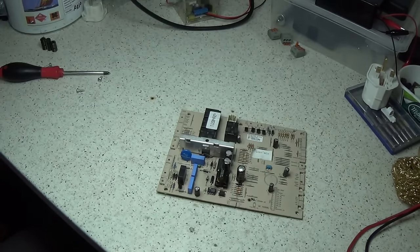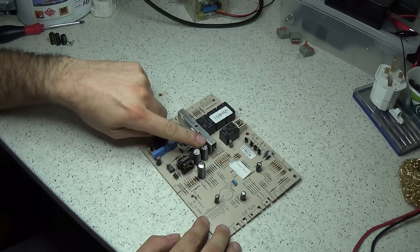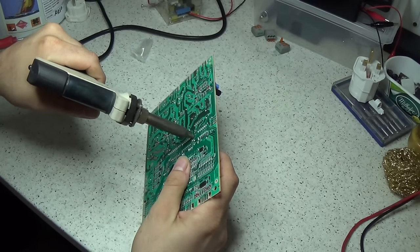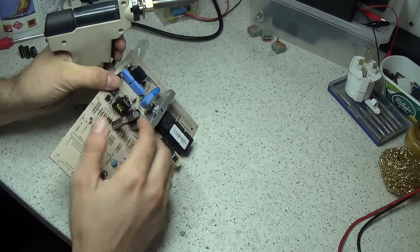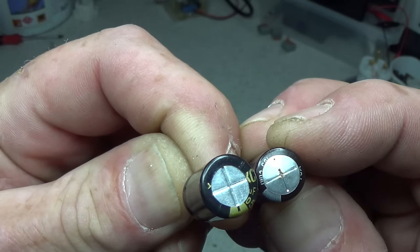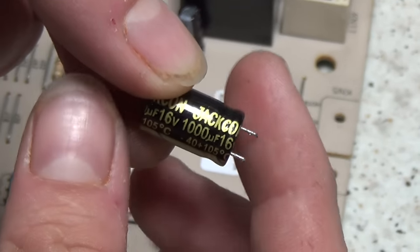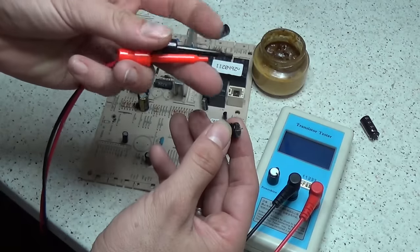Sometimes you will need to desolder chips to actually test them. We test them with a capacitance resistance meter, which I'll show you in a second - these can be bought quite cheaply. I've put some links on the website to the specific testing tools you need. We're using a desoldering station here - I'll also put a link on to that as well. You need to desolder the capacitor first. We can physically see that it's got a domed head. The new one is exactly the same microfarad and voltage, but it is slightly smaller - the technology has moved along and things get smaller.